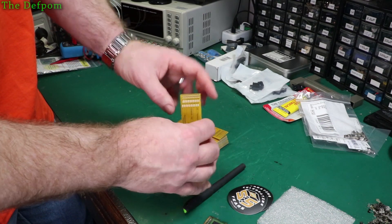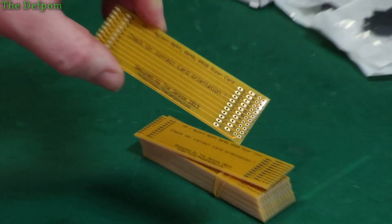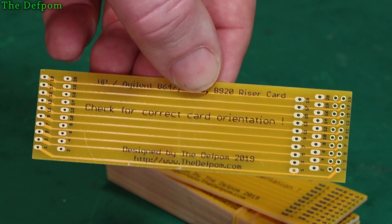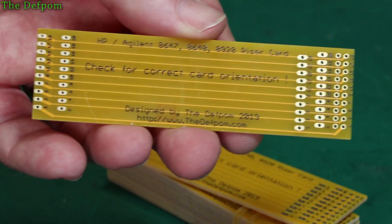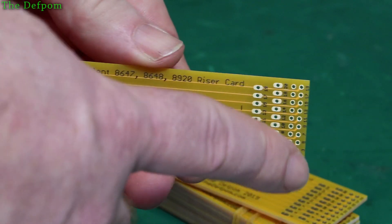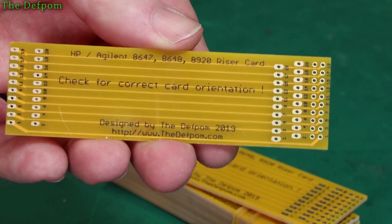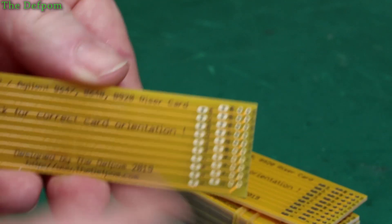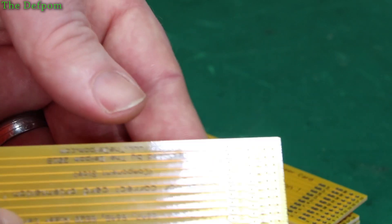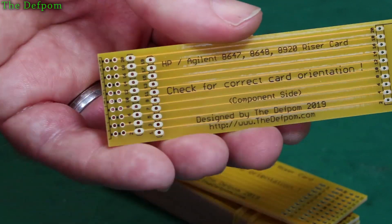So I don't have any flood fill or anything — none of that on there, it's just the traces themselves. And this is ENIG as well, so it's gold plated — immersion gold — because I wanted these to be nice quality boards with good connections, and things that should probably sit around for a while and maybe not be assembled straight away. Let's have a quick look and make sure I haven't messed anything up. I had to communicate with them about how to set up this header here, because the footprint I'd used was not really the right one — it's just what worked. It's actually a right-angled footprint which hung off the edge of the board, and so they were a bit confused saying the footprint and silkscreen go off the edge. I said don't worry about it, just cut it off.